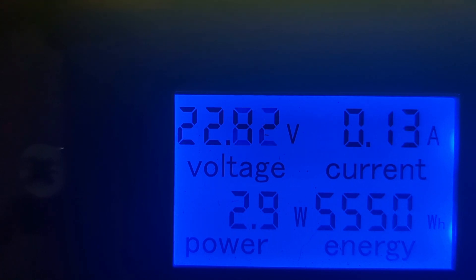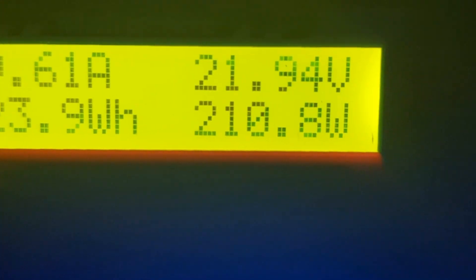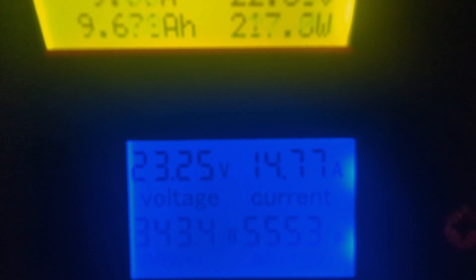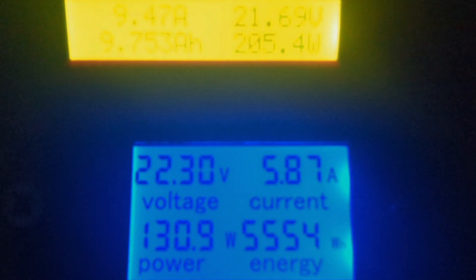So now the turbine's battling against the weak batteries and doing very well. I've not got a light in here — let me try and get a light sorted. I'll leave it on there for a minute. It's still plugged into the dump load, so the battery is trying to drain itself basically. There's the power that's getting drained through the dump load. It does vary quite a lot depending on how much power's coming in — you'll see it's going up there. Now you see it's on 225. The water's already getting warm, believe it or not. Turbine's doing better than I would have expected, really.